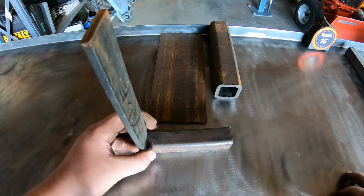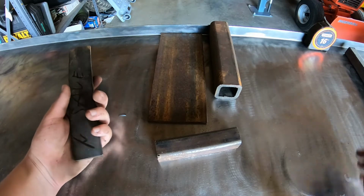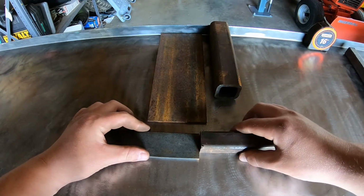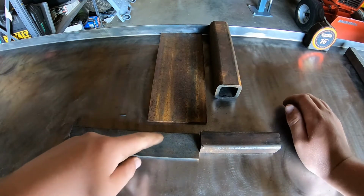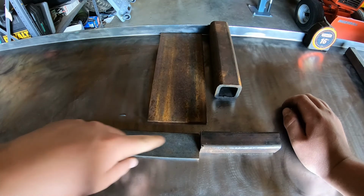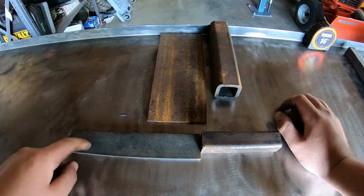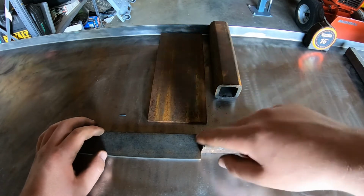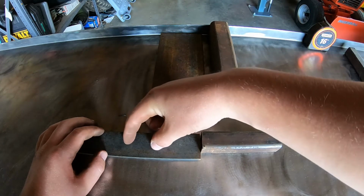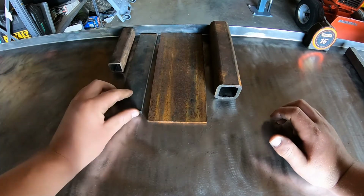And I have two options. I can either cut this and weld it, or I can use my handy dandy metal bender and bend a 90 in it, so that this end would come up and then this would weld to that, and I got a piece sticking out. However, it's going to be kind of weak, so what I'm going to do is I'm going to stick it out a little bit further where it needs to be, kind of like this, except, you know, this piece will be bent up, but kind of about here. And then whatever I have left of this material, I'm going to cut that off, and then from the part that's not up here, do a 45 down to it. Because I want to have about this much spacing, you know, so I got room to get the trailer turned around and stuff.